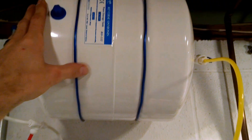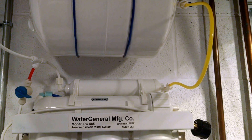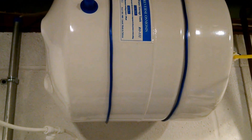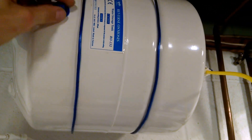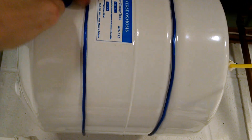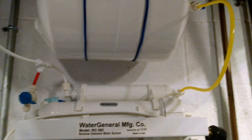And then you have your tank, which I think fits about a gallon and a half — depending on the pressure, two gallons. I mounted that as high as possible because this line right here is actually going all the way up to the sink. It's a 50-foot line, so you're really taking a vertical rise from here to about three, four feet before it actually comes out of the spigot. So you're going to lose a little bit of pressure. I actually use this air pressure nozzle here to increase the air pressure just a little bit so that the tank is pushing a little harder against the bladder to help push it through that 50-foot line and up that four feet to the faucet. That way, when you open the faucet, you actually get a decent amount of pressure.